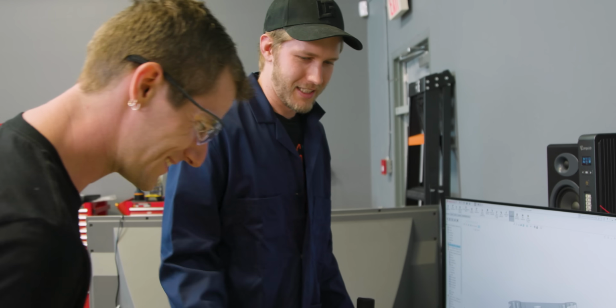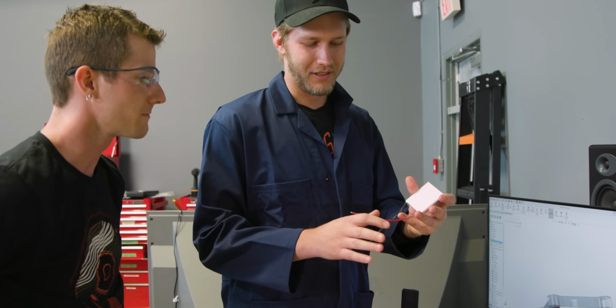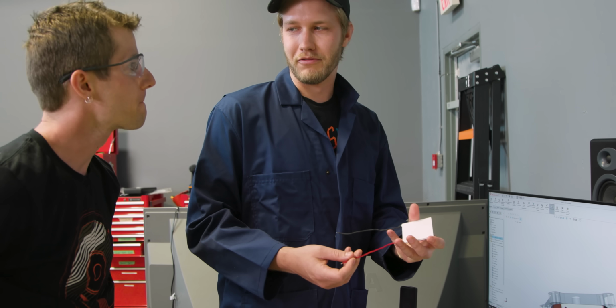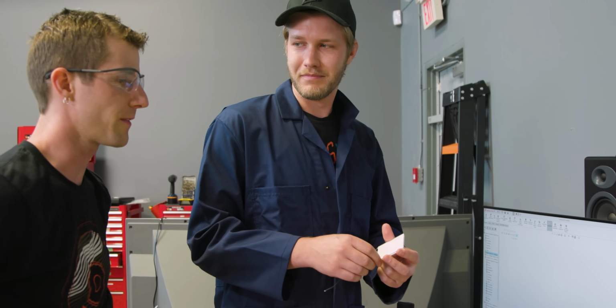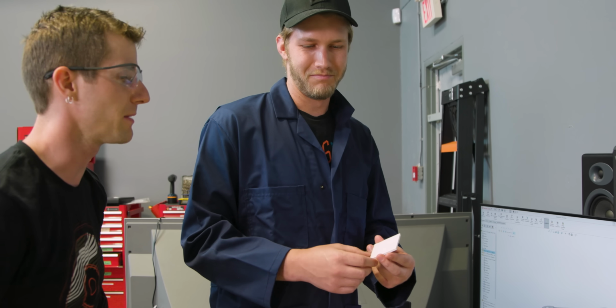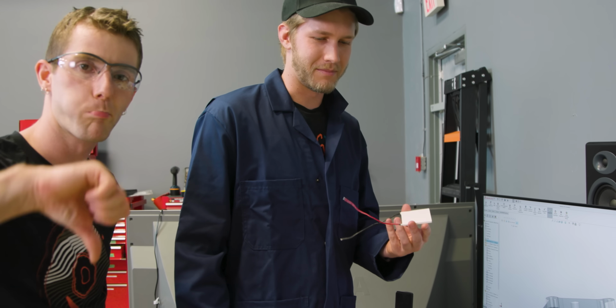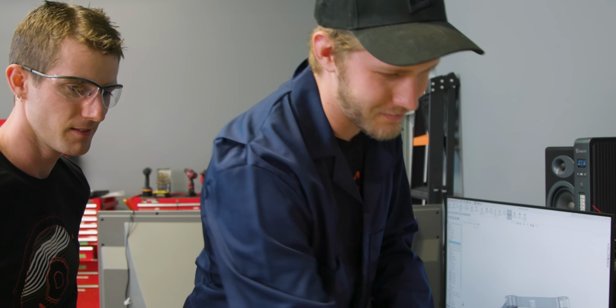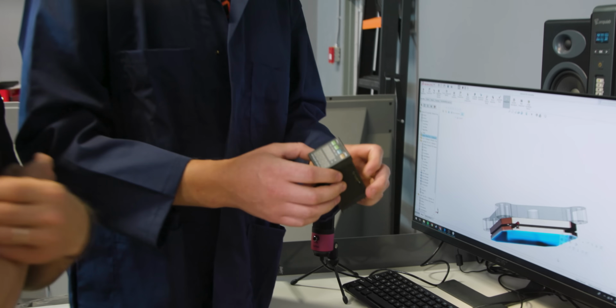Yeah, so another problem that we have is that if you just put this on full bore, like if you just attach it to a power supply, it's gonna cool down really, really fast. And really cold. Yeah. So we could end up with condensation, lots of water around your CPU, not a great time. So that's why we have this guy right here. It's a PID controller. And do you know what PID is?